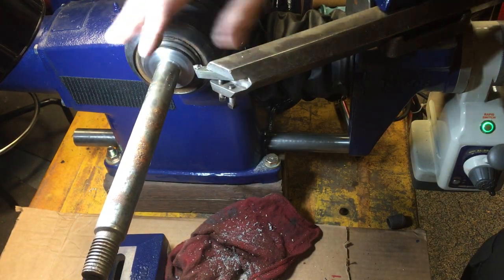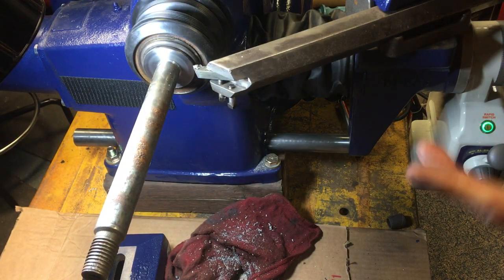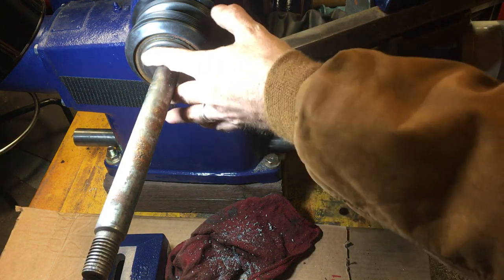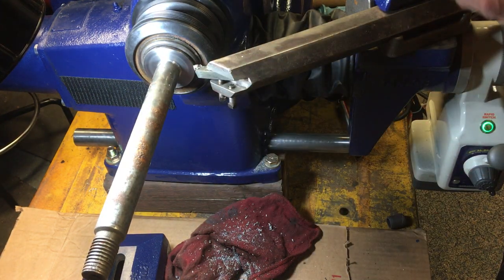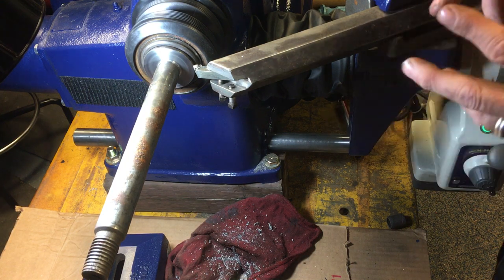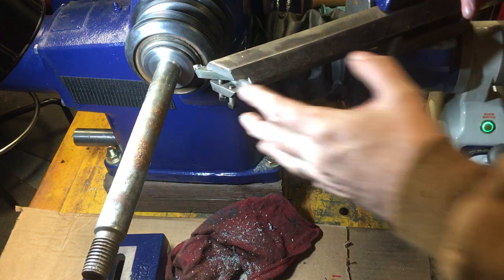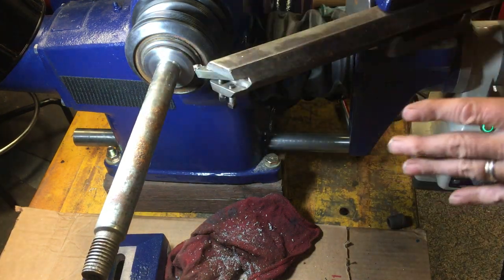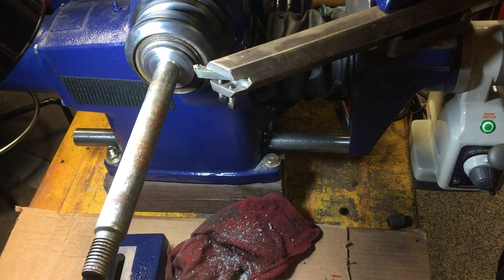If they're using aluminum cups on the inside, that's not a problem. But if it's a steel cup, it can be a problem. Also, it's really important to keep this clean. So if somebody's put dirty cups and cones on there a million times, it's created dents and high and low spots in there. Cleaning this up to an exactly true face takes care of a lot of the problems that you can run into related to the arbor.